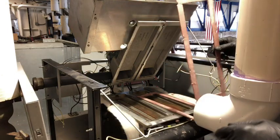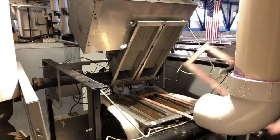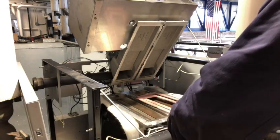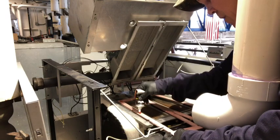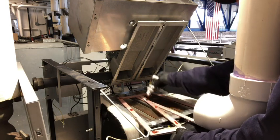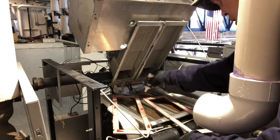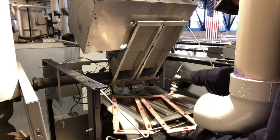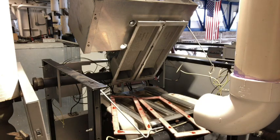As you can see, the difference between here's the replacement and here's the original factory seals. So that's how you can usually tell if they've never been taken apart before. So I'm going to take and just put a little bit on the corners of this. You want to lower the heads down on. Sometimes they'll tend to slip on you and all your bolt holes get messed up. So we just take our time, in no hurry. We'll get this down, and while this is setting up, we'll go ahead and do the yearly maintenance, which is replace your igniters and flame sensors.